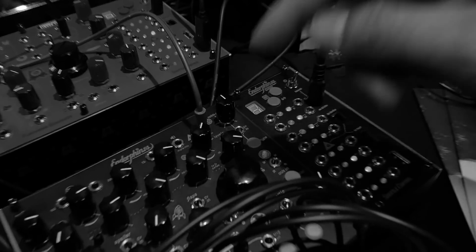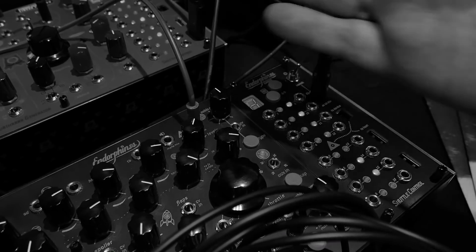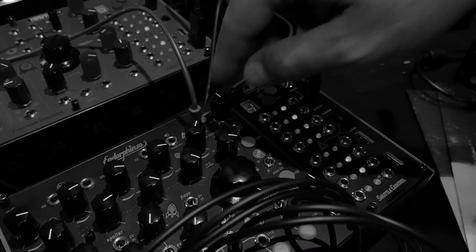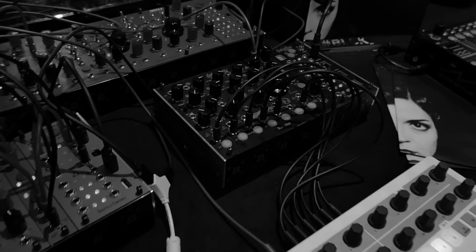That's basically it. One thing to mention, the freezer or kind of looping thing: if you go in the middle position, you're dead on, so you're repeating exactly what it is. So this is the tempo and this is the size. If you're in the middle, you're making a perfect loop. And with CV applied, you could play it literally 1 volt per octave, and the same, you're applying gate down here, so you can work with pretty advanced sequences, making nice little ratcheting kind of things, and making more complex stuff. Also working with the sends while using it could be very fun.